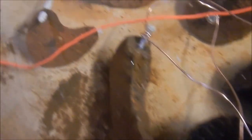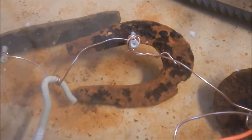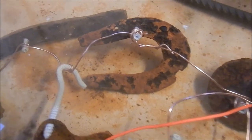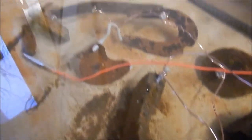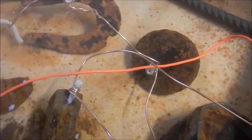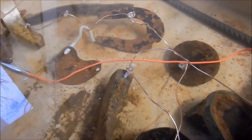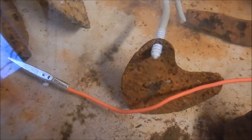In order to get good electrical contact, I've drilled small holes in each of these pieces and put a screw in it. The idea is that the outside surface of the relics are so encrusted that you'd never be able to make very good electrical contact. You may cringe at the fact that there are holes drilled in these things, but once it's finished I can fill them in with black epoxy and you'll never know there was ever a hole there. This lock plate actually had a hole there already, so I didn't have to drill it.